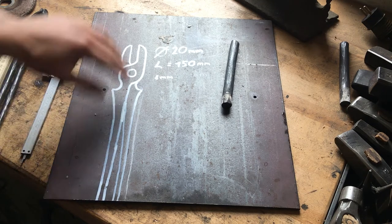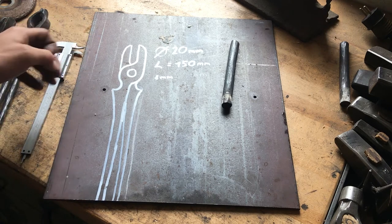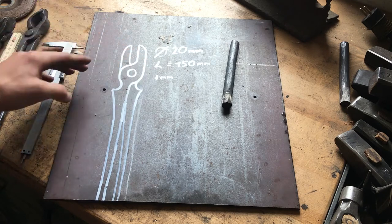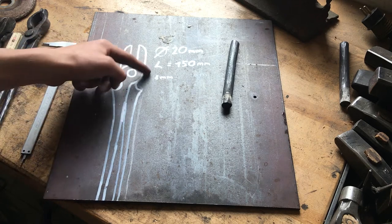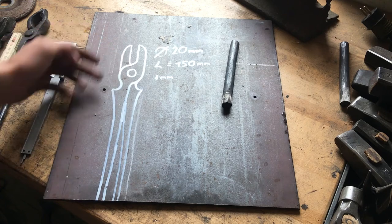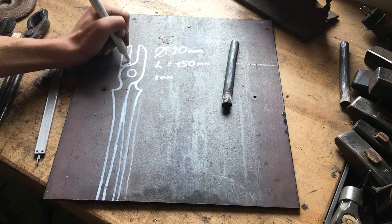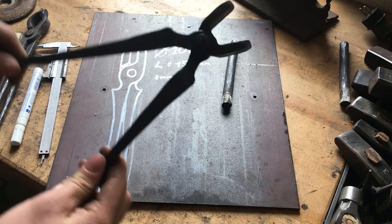It's important to keep your lines clean so you don't struggle with how the shape is going out. That boss needs to be a bit round, have some shadows of that square shape. We're gonna fuller it in, set it down, but it should be round. So this offset here does not touch your boss. You want them to articulate free, like so.